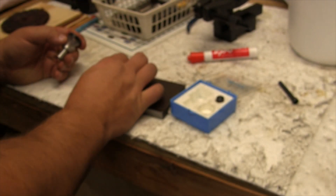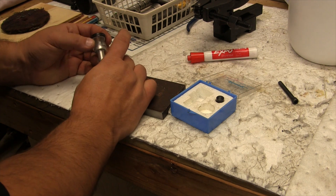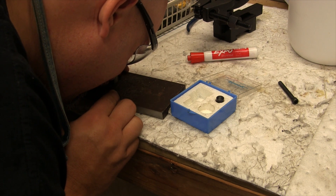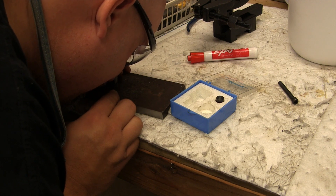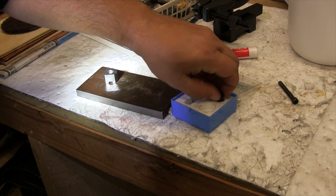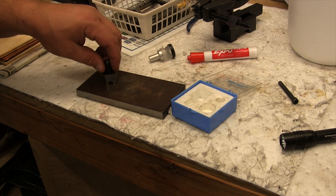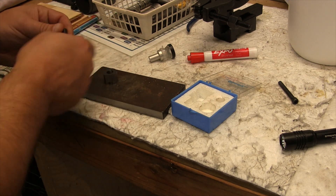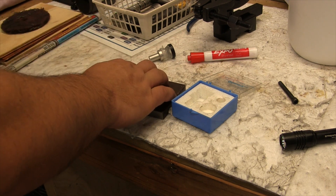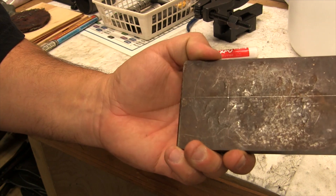You put this bushing on here, which is magnetic, and it's got a little slot in there — you see that slot? That allows light to actually get in. So we line up our crosshair, then you lift out the optical part, put the center punch into the bushing and give it a nice little love tap. You get yourself a nice center punch.